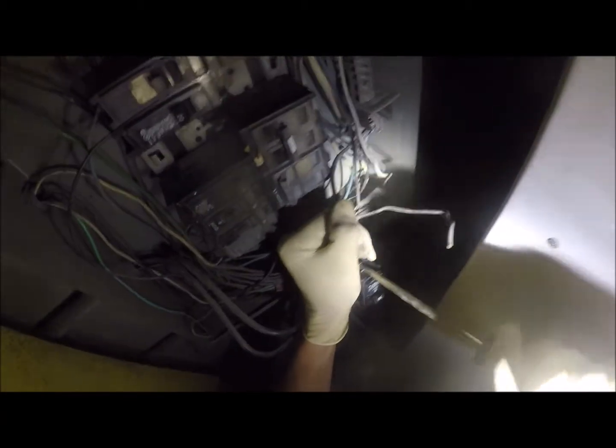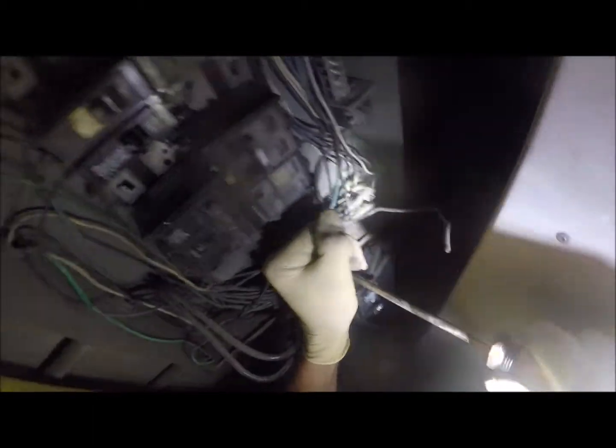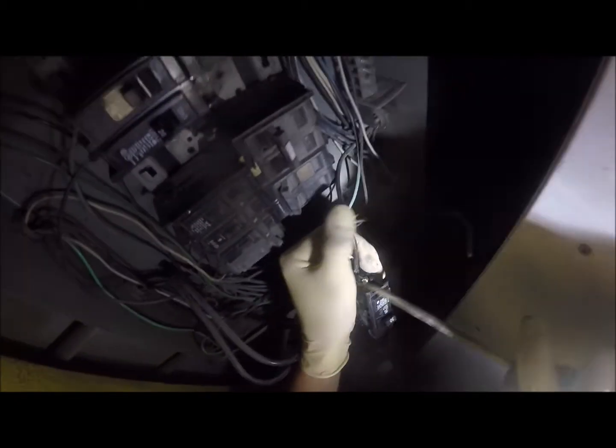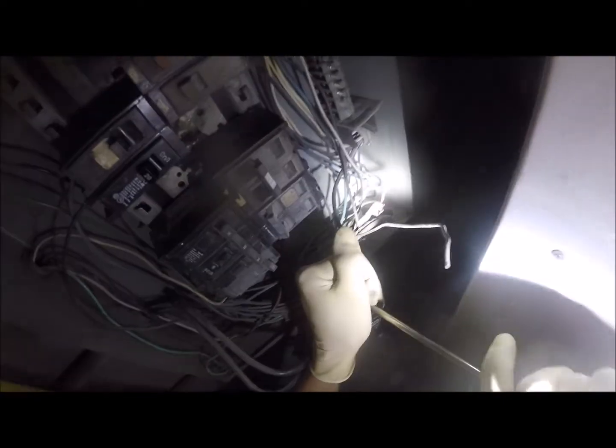That was one problem I had with one particular breaker years ago. The amperage was there, but they did not give you the room to put the size wire you wanted to. Wound up having to run a heavier breaker. I was doing a sub panel, I think I was trying to go with 70 amps, but I wound up having to do a 100 amp breaker. It was a sub panel for 100 amp service anyways, so it wasn't going to kill anybody. So let me pull this 20 back out of here.